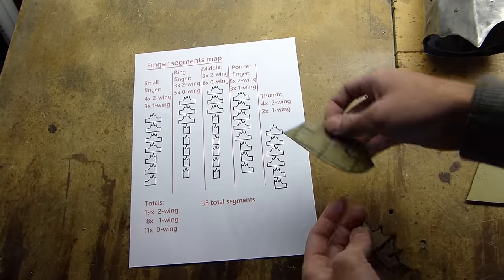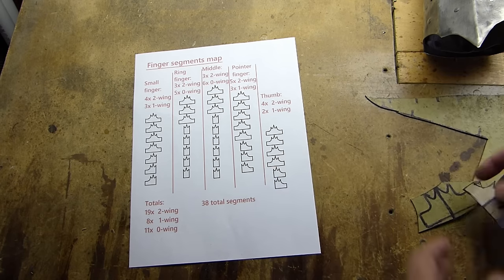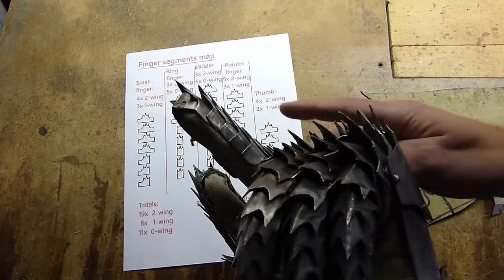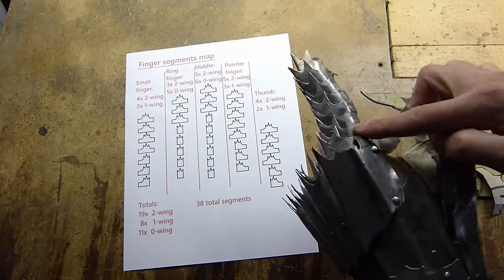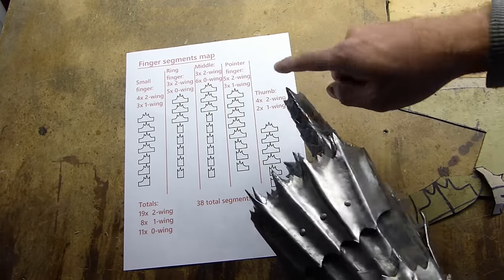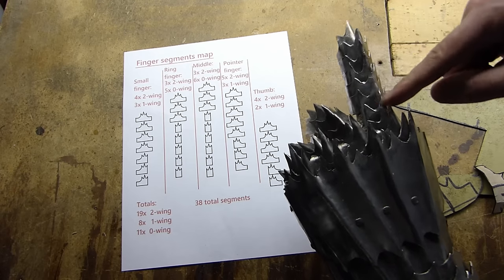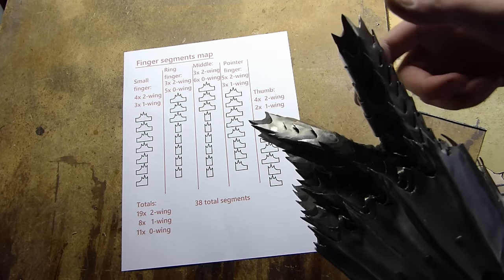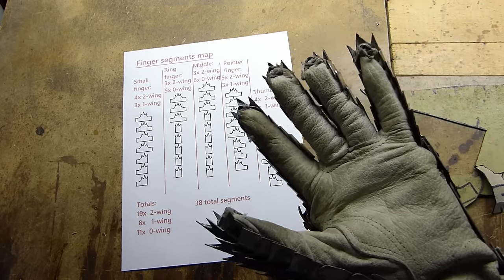The point of knowing this is so that you don't have to cut all of them out full size — you can save steel and save cutting time. To clarify: on this finger, since this finger is out on the end, it has these going most of the way down. This entire side has wings sticking out. But on this side, on the inside, it comes back to a certain point, and behind here there's still three more plates but there's no more wings on the inside. This is to allow the soft part on the inside of the finger to fit nicely so your fingers aren't pushing each other apart.